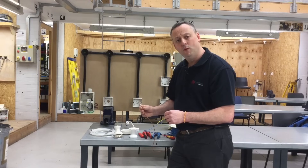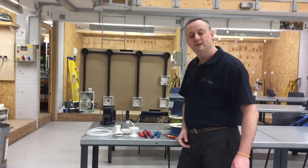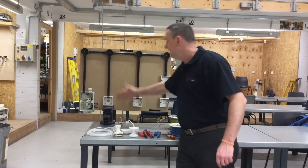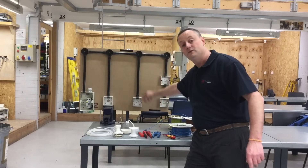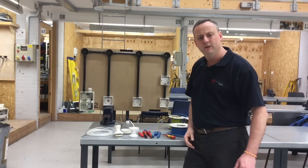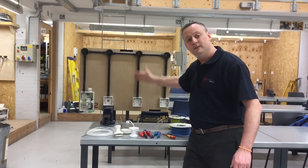Let's see how we're going to wire a simple one-way light switch and lighting point. We've got a pre-tubed exercise board. The first stage is to have this one-way switch controlling this light, then extend it to a second office where there's a one-way switch controlling a light, and then a third — so we're at stage three. We're going to practice the conduit looping method and build it up in three individual stages.